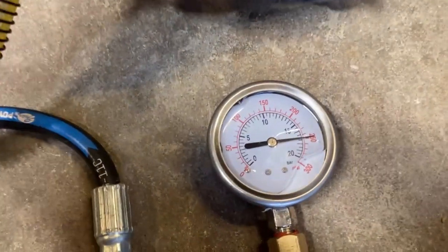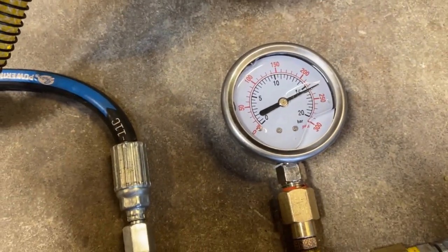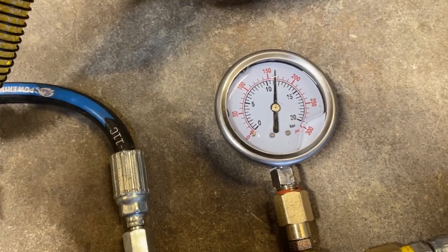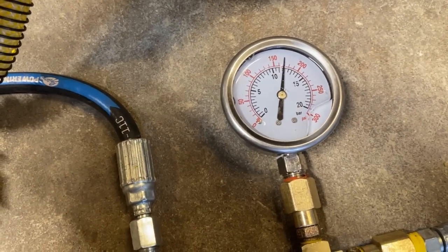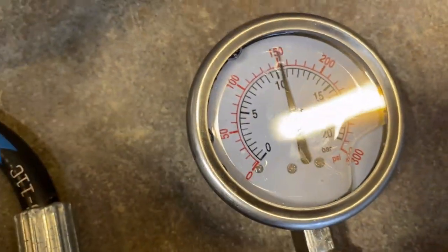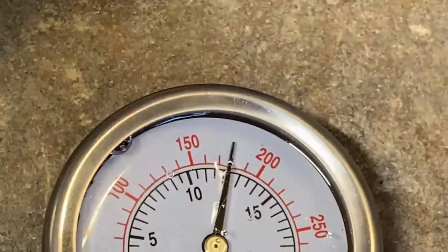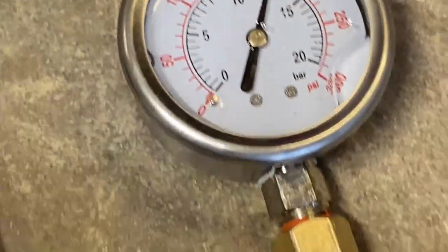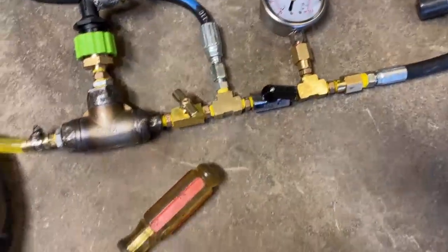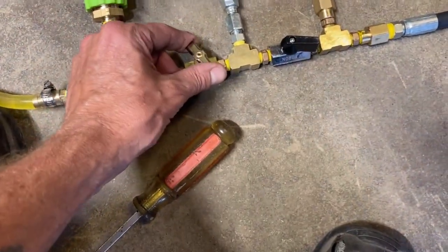How low can we go? Let's say we want to light it at 150. I didn't like that much — it's still spraying in there. We never want to run it under 175 unless we make adjustments to the pilot system. This valve here would allow that.